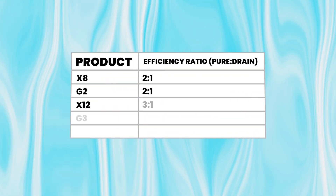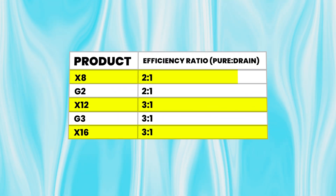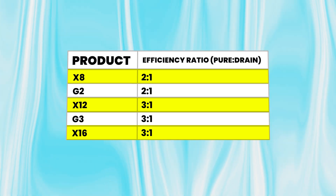I also need to mention that this system wastes water, which is an unavoidable side effect of all reverse osmosis systems. Waterdrop is well known for its claimed high efficiency systems, and the X12 and X16 models with their 3-to-1 drain ratio, and the X8 with its 2-to-1 drain ratio, are no exception. Like all tankless RO systems, the X series is susceptible to TDS creep, which can temporarily increase the TDS in the purified water when the system hasn't been used for a period of time, affecting its performance efficiency.